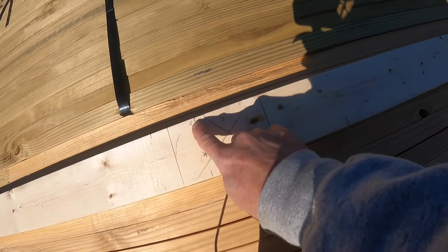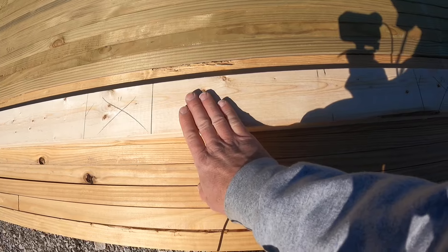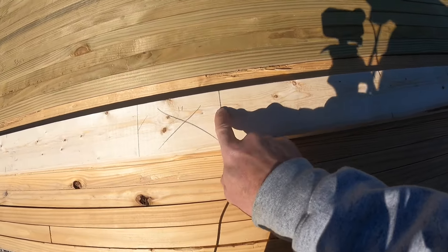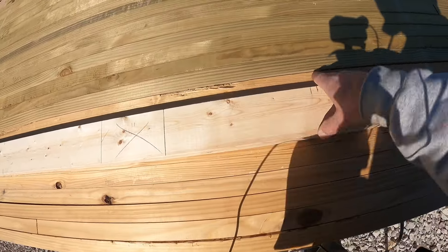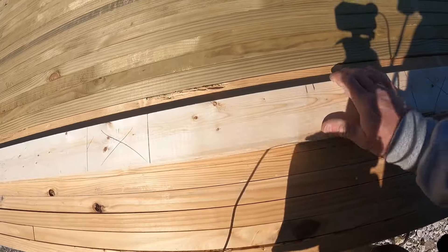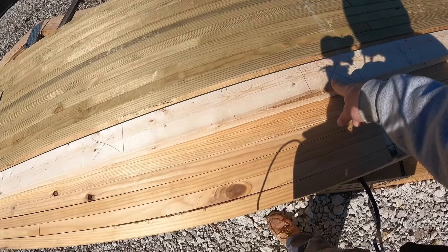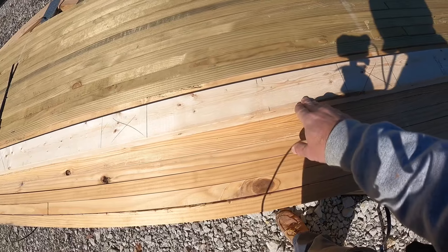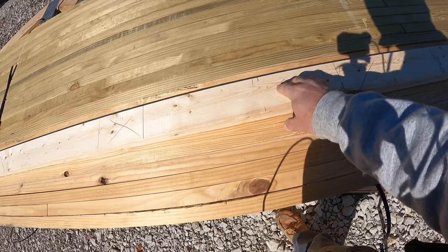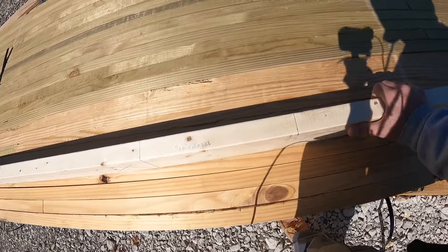For the nine-foot porch ceiling, I measured up 38.5 inches and placed my two-by-twelve rafter header there. Measuring down 11 and a quarter inches lands me at my porch header location. There's a girt nearby, but I'll need a nailer for trims so I can add a two-by-four or two-by-six there to have enough for all my trims above the porch. I'll mark that, and this side of the storyboard is done.